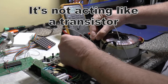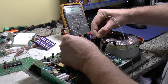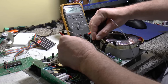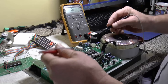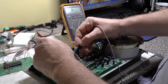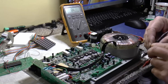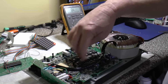So we've got a short circuit - earlier I didn't have one. That outside pin is open circuit, but this one to this pin is a dead short. I had that earlier, but now I've got half a volt. That would suggest something's turning on and shorting those pins out.